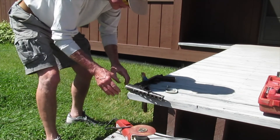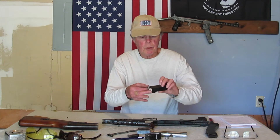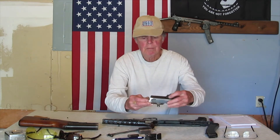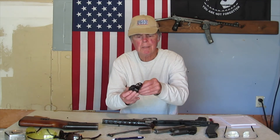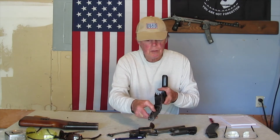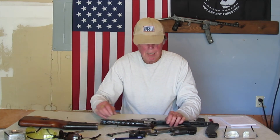That'll make everything work a little better — those burrs were keeping it from going together. I've got all these parts smoothed out right here where they've been torch cut, so they'll all fit on and go over the bolt instead of the burrs getting in the way. On the front side I was able to knock the piece of barrel out, which was good. My next challenge will be to get out this torch-cut barrel by trying to knock this pin out, and then I can start putting the mock-up together.